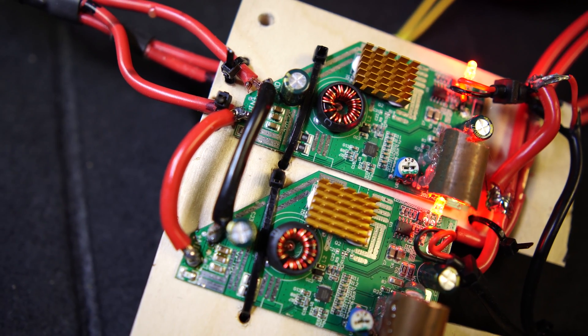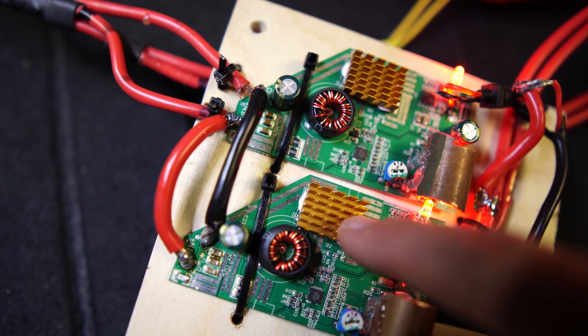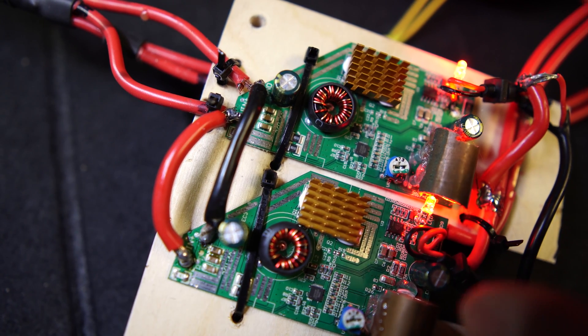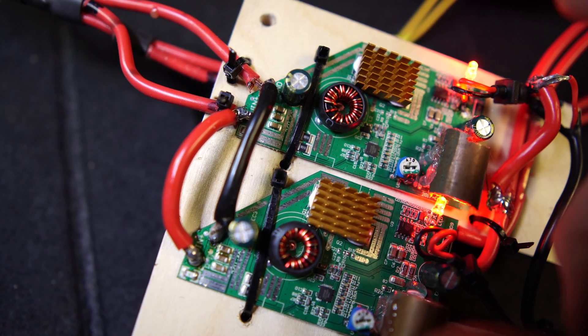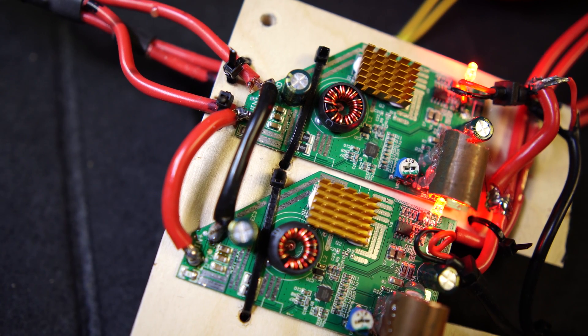Just an update: we've been charging for a few minutes here and these are the heat sinks I've taken from the LTC 3780 — they are aluminum. Now they are too hot to touch. I don't know why the manufacturer would put MOSFETs without a heat sink when they get this warm inside a plastic casing. It just doesn't make sense — it's going to burn out, it's just not good for it.